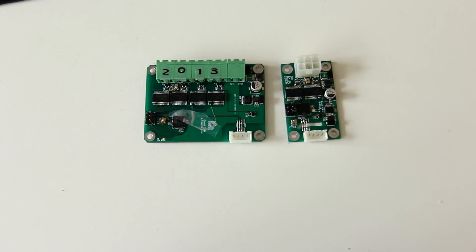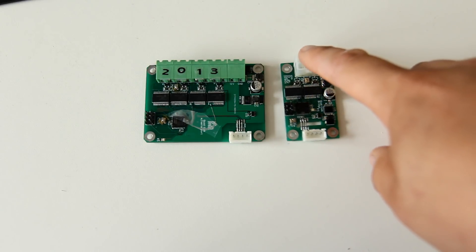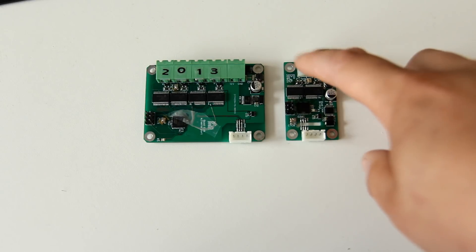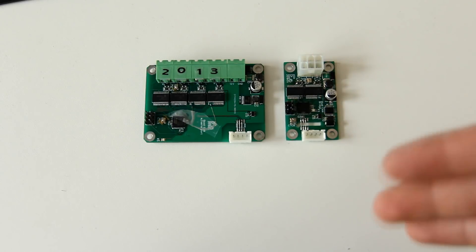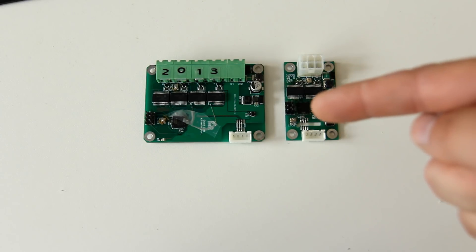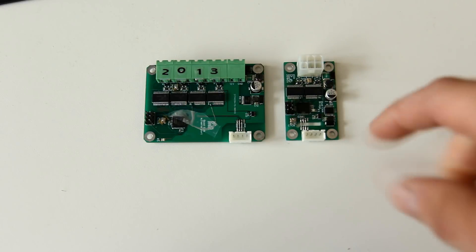These are two PCBs that are essentially just giant CAN bus bridges. This PCB is an actual bridge — via this connector it gets power on two pins, two pins are one CAN bus, and two pins are the other CAN bus, and this acts as a transparent CAN bus bridge. Messages come in via one bus, this PCB receives it, possibly modifies it — I'll come back to that later — and then sends it over the other bus, and vice versa.